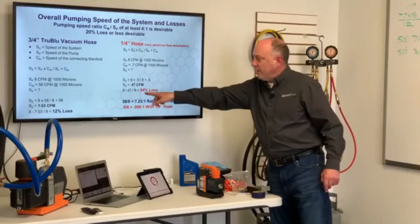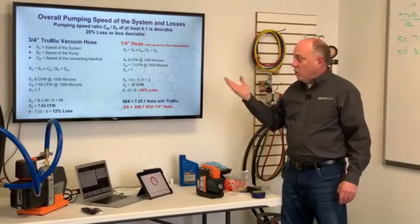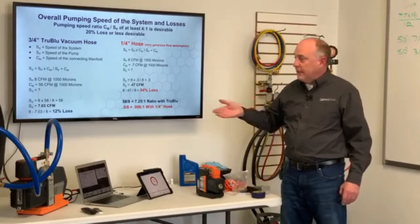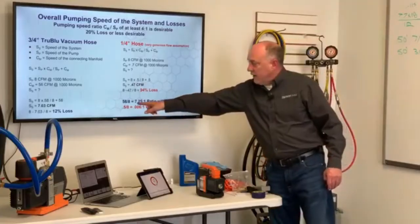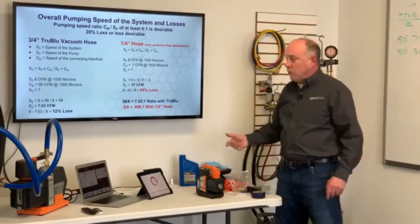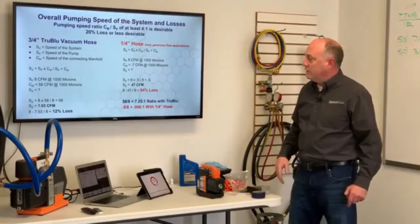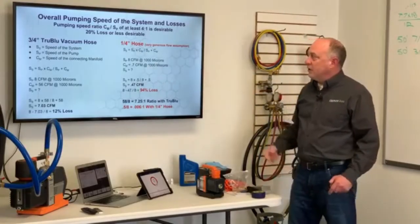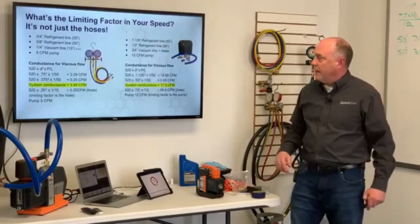Well, 0.47 divided by 8 is 94% loss. So with that 1/4 inch hose, we've lost 94% of our evacuation power, let's say, versus 12% with the true blue hoses. The true blue hoses are a ratio of 7.25 to 1 versus 0.006 to 1 with 1/4 inch hoses. So again, this is why it takes so long with those 1/4 inch hoses to evacuate the system. A 20% loss or less is desirable, and you can see with a 12% loss, we're well within that range.